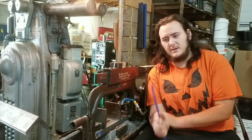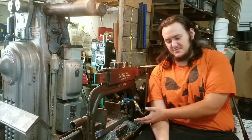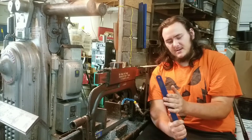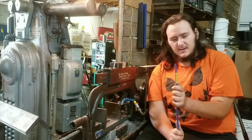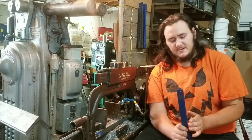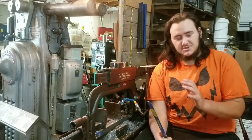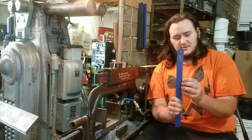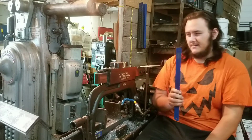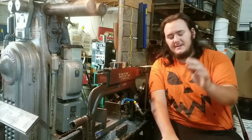Find the coarsest blade you can, because that will cut faster in thick material. If you want to cut thin tubing with a hacksaw — firstly, why would you? Get a bandsaw for thin tubing or structural elements. These hacksaws are good for thick, not thin. If you have limited space and need to cut smaller material, get a higher TPI blade. A lower TPI is better for thicker material — there's more room for the chip to build up and more pressure per tooth on the work. To close out this video, I'd like to issue a small challenge to anyone with a metal cutting machine.